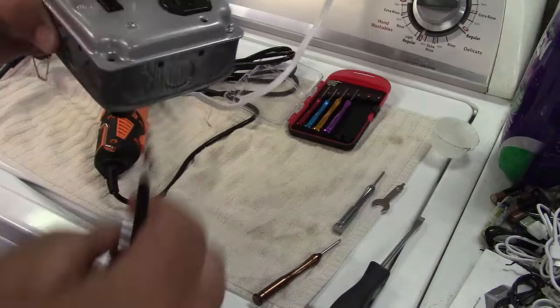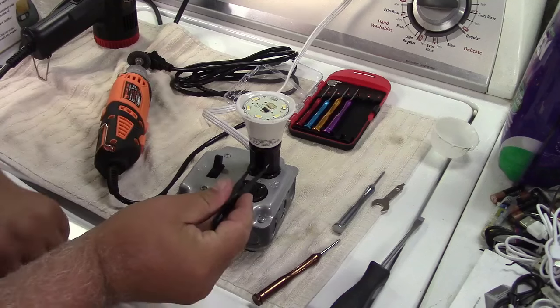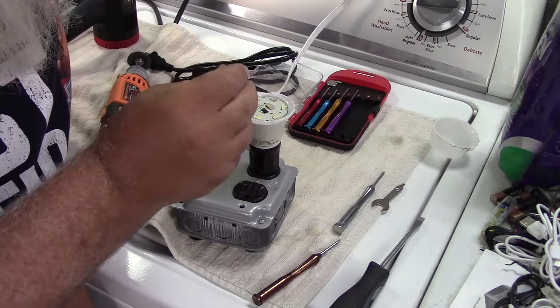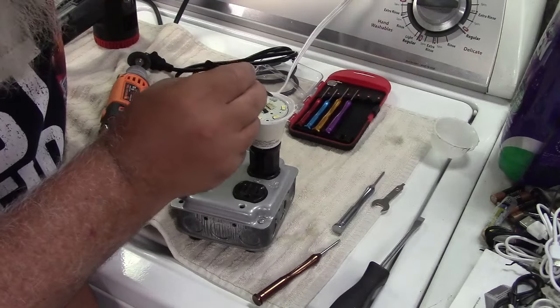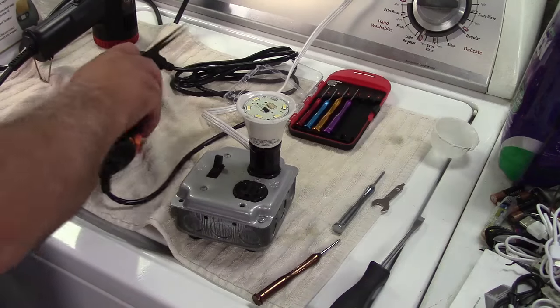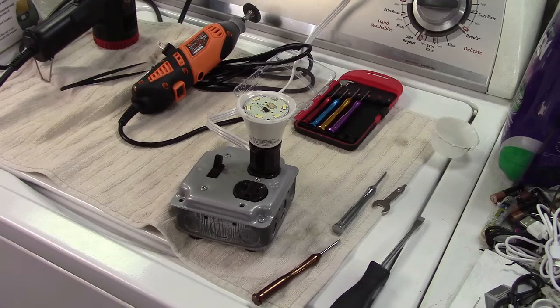Well, okay. That's live because I'm holding it, and this is plugged in backwards. This is not polarized, so that's what it is. Okay, but if I just short right on that, there you go. So basically, I could just solder blob over that, and it'll work. For how long? Not long, but hey, at least we're going to fix it. It doesn't have to last long, it just has to last long enough for the video, and then I'll end up having to get a new bulb anyway.